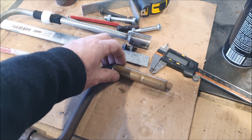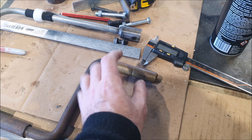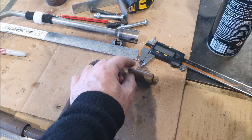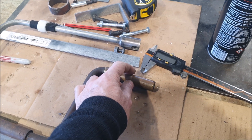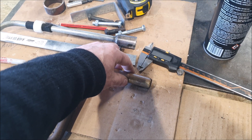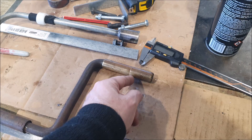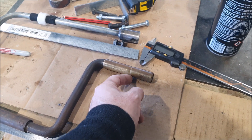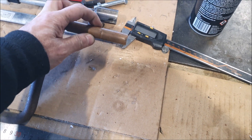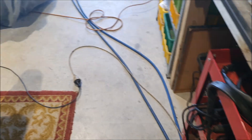We were talking about how you do this little crimp on it — I did think about modifying the bead roller to put that in, but then Bruce and I both had the same idea: using a little tube cutter or pipe cutter. I've got a really crappy one that didn't actually cut tube very well. I can modify that, and if I anneal the brass tubing I should be able to put this little dimple in there — that's what keeps the handle in place, which is a neat way of doing it.